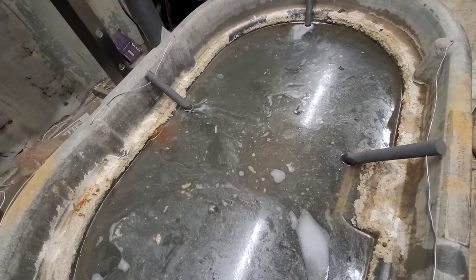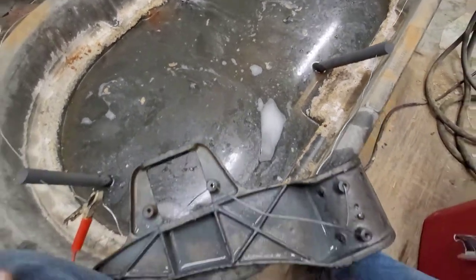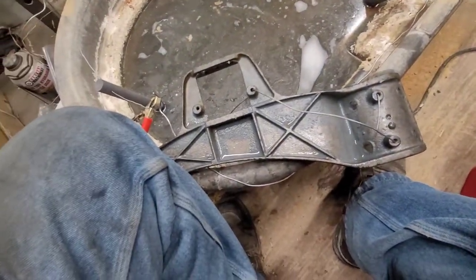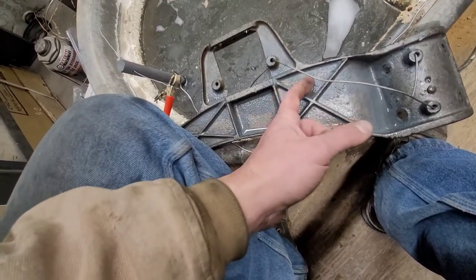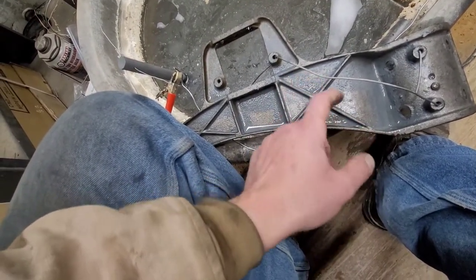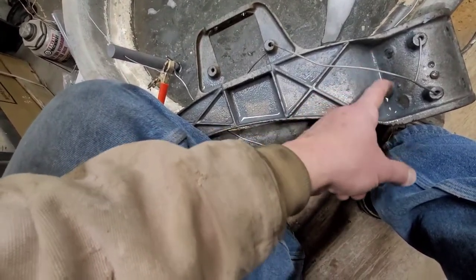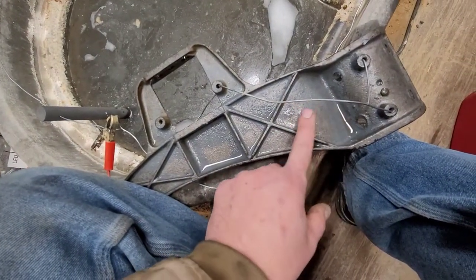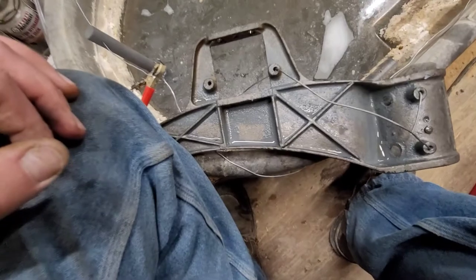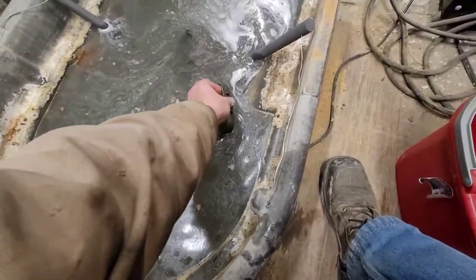Just a quick showcase of how I work on a lot of these older machine tools with castings — seems to work pretty well. We're going to take a wire brush to this and get the remnants of paint out of these little rough parts of the casting, but as you can see it's just kind of flaking off. I actually put aircraft remover and citrus strip on this and neither one of those products touched it — it's tough old paint.